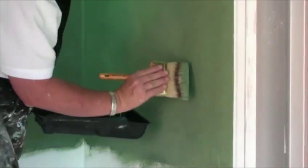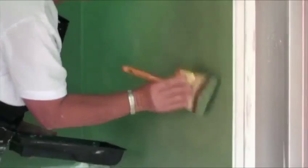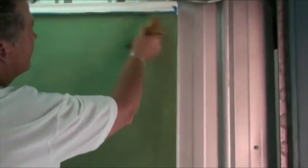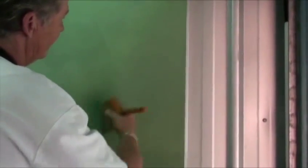Later, this edge will be covered with a timber dado line. See how the badger brush is held in the palm with all fingers across the ferrule — this gives good support to your brush. The pencil hold is a no-go; one would probably end up with a blister and there's no support to the brush — it would twist and turn. Rather than place the brush into the dry area, start from your wet edge and work it into that area. Keep working your wet edges; don't let them dry out on you.